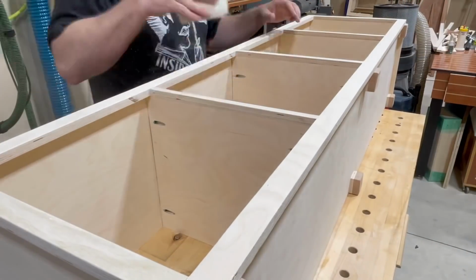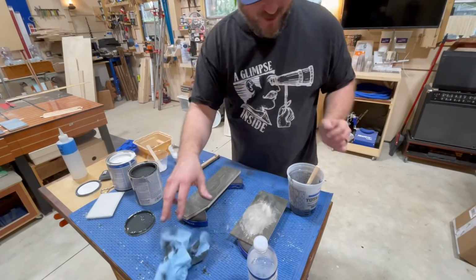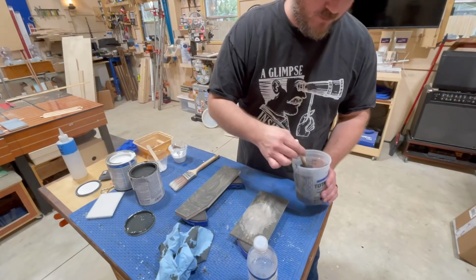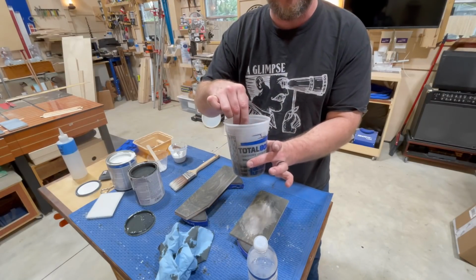And let me explain how I'm gonna do this faux finish. This is my first time, so get ready. After attempting a few different techniques here, I've got more boards over there. I've decided to not water this down. You thin this stain down with mineral spirits. There is literally just a sponge worth of stain in here with about 6 ounces of mineral spirits.